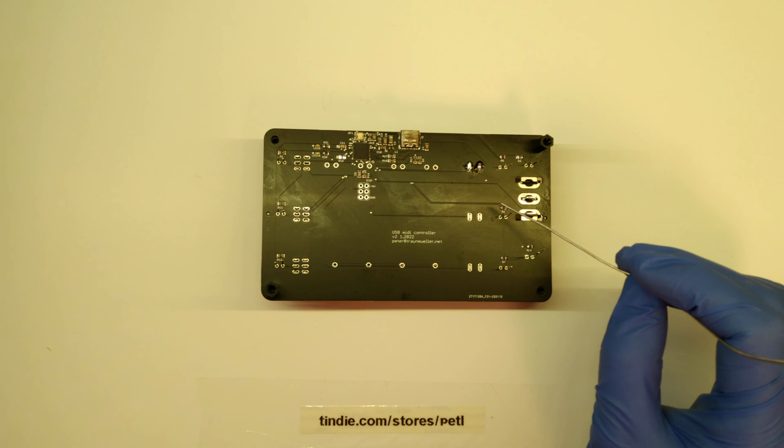After the push buttons, the second thing I'm going to solder on is the rocker switch. This switch is actually rated for, I think, 10 or 16 amps, and we're switching, I don't know, not even a milliamp through it. That's why its spade connectors are this big. I'm not going to solder them on fully, because that's completely useless. In this application, I'm just soldering it so that I know that nothing will fall out, and that everything looks good on the back side. The third hole for the rocker switch is so that you can mount it upside down, or you could theoretically even mount one with 3 positions, but electrically that would not make a difference anymore. It's just for your personal taste.